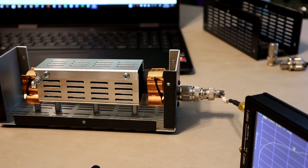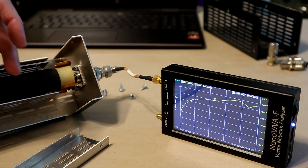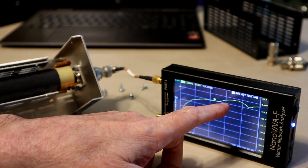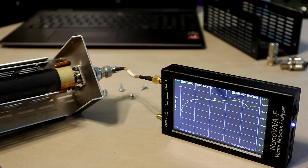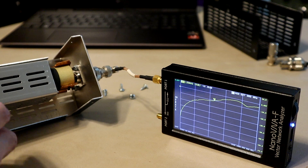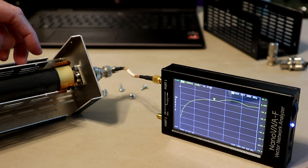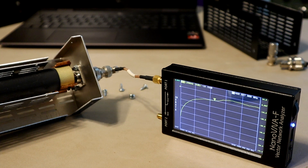Let's take this top cover off next. With the top lid pulled off and looking at the S11 plot, we see it's degraded a little bit in this region compared to before - not a whole lot, and hasn't shifted much. Why is it not a lot degraded? We might think this cover is important as a shield, but it's not the shielding that matters. Instead, it's important that we have the right capacitance between this resistive element and the outer conductor around it.